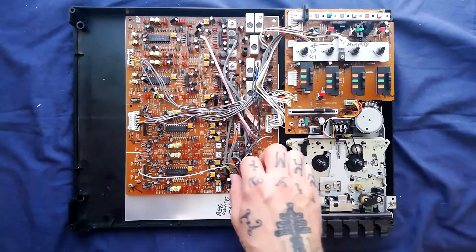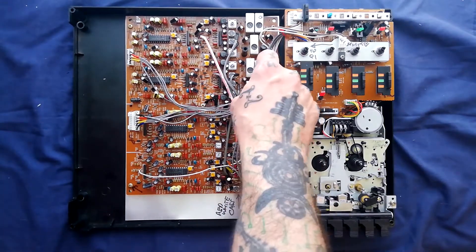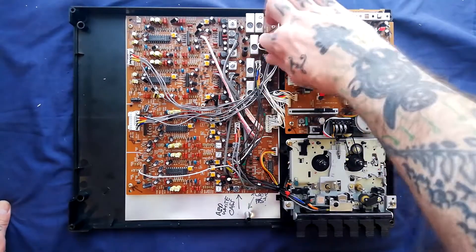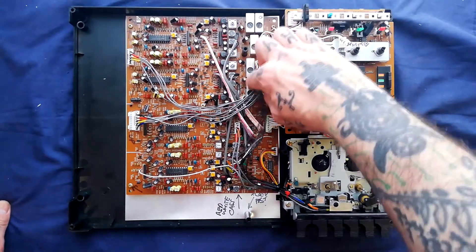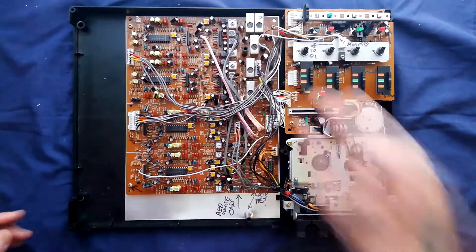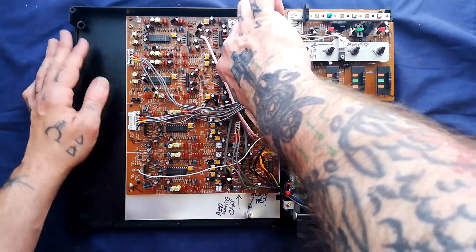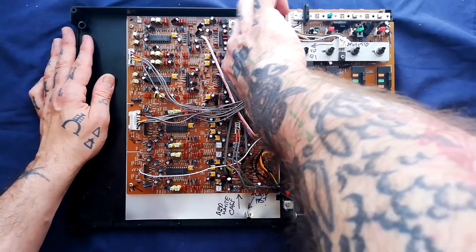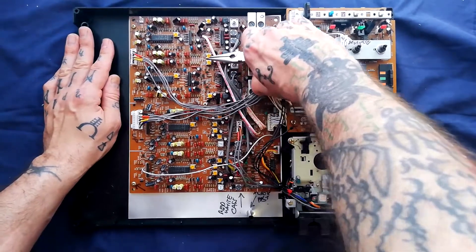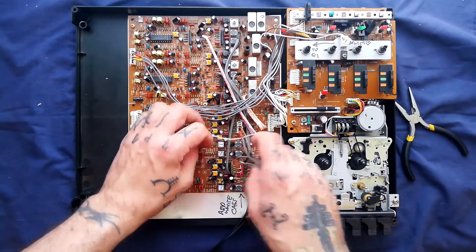Now we can focus on getting the transport out. We'll start by disconnecting the magnetic heads. The erase cable — with the black ones — comes up to the area of these variable inductor oscillator controls. It's immediately to the right of the third one down. The cables are thin and probably not that strong, so I want to grab that with pliers to put all the pressure onto the header itself and not the cables.